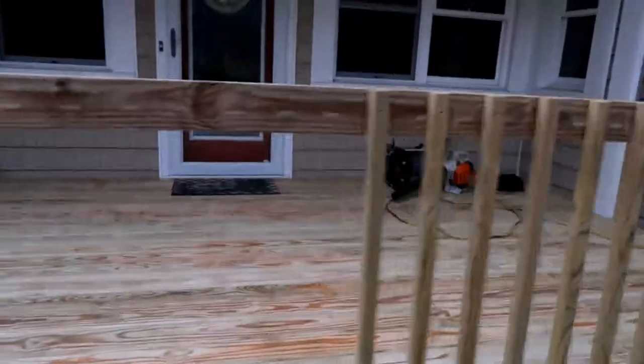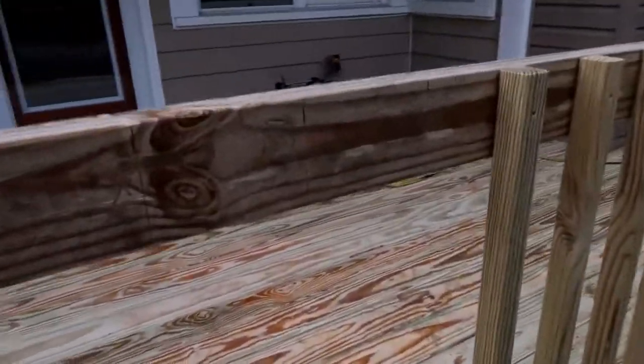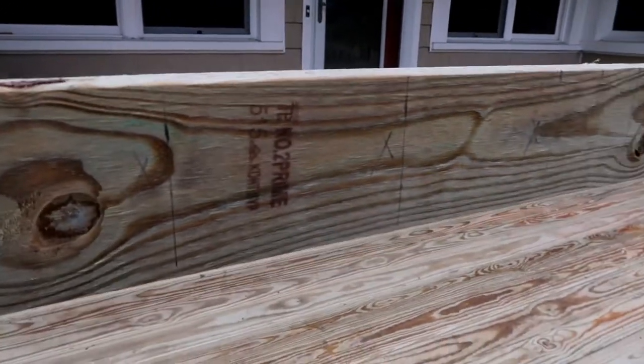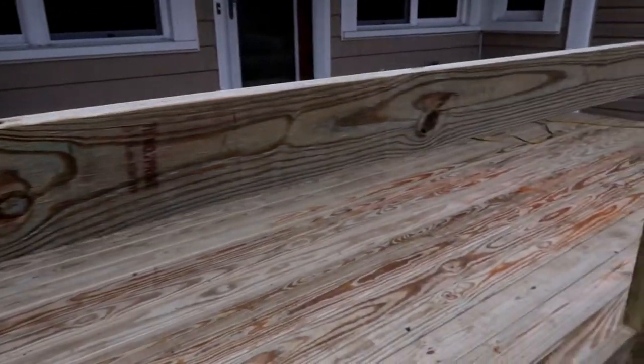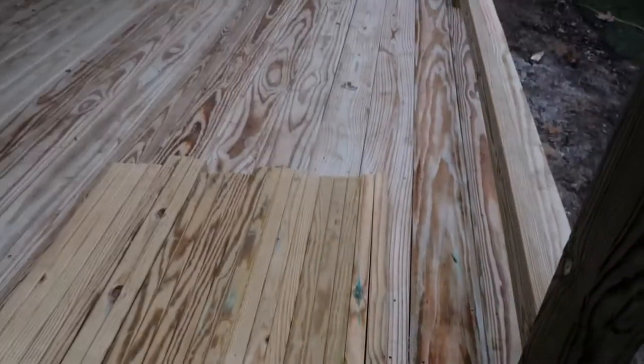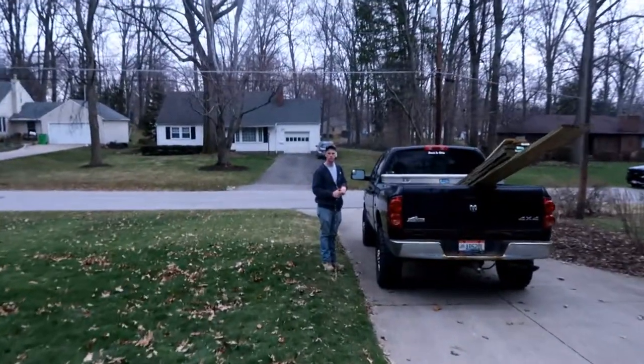We got partial railing up. After the rails are up, I lay out the balusters at five inches on center. Another tip: pre-drill the balusters because they will split — not every one, but they will. We pre-drill them and screw them in.